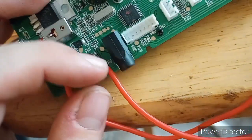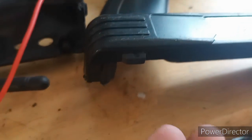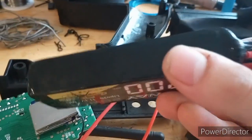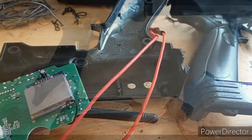This doesn't affect the DC port — you could still plug in via the DC port if you wanted to without a battery in. We're going to put this back together. I took the battery tray out, and the plug should come right through there. Then I should be able to fit a 3S in there, or maybe a 2S if it'll run off a 2S — though I don't think it will. I do have a 3S here that I believe just barely fits, though you might have to cut some plastic to get it to work.